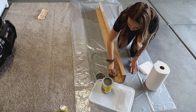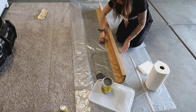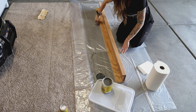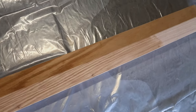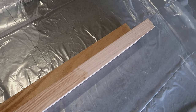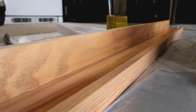If you are using a paint brush or stain brush, make sure you have a rag or paper towel on hand to wipe up any excess. You don't want your wood piece completely saturated — a little bit goes a long way, so use it sparingly. You do not need a huge container of stain for this art ledge. I did end up doing two coats. You can also go back in with a different stain color. You do not have to stain your piece — I chose to because I wanted a different color look than the natural red oak.